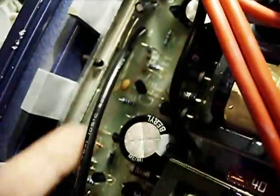And there's some more transistors over here. A couple of big power resistors down there. Those are most likely gate current limiting for the MOSFETs. And more other miscellaneous passives, like stuff over here, which is for driving the H-bridge MOSFETs. And other than that, there isn't a lot else to see, because again, it's just a fairly typical standard Chinese driver inverter.